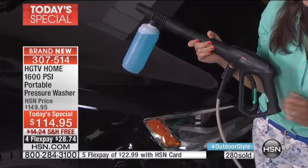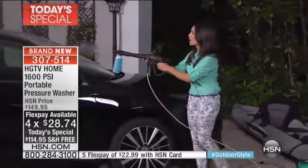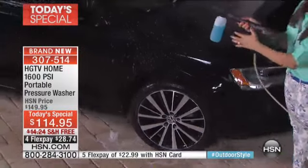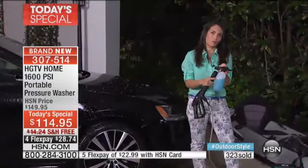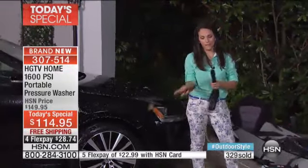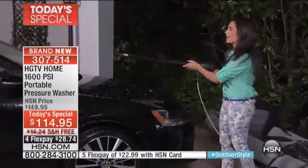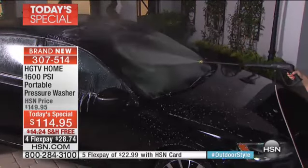This is a lower pressure and we have it that way for a reason — it's going to let the soap get on there. You can get those nice wheels, get in those rims. For your decks, your furniture that's outside, you're going to put your detergent right in here. You're going to use the right amount — not too much, not too little. To take it off, I put that wand back on there — it clicks right in place. We have that 25-degree tip on there. You don't need a bucket, you don't need a sponge. I'm not even getting wet.